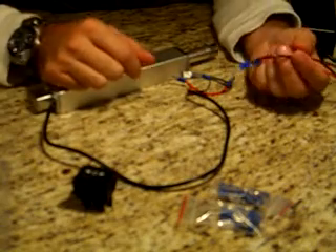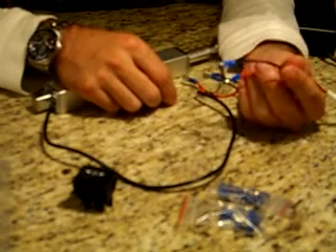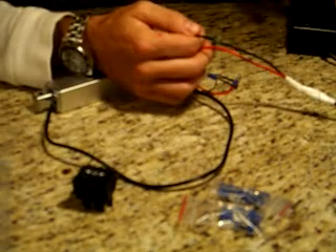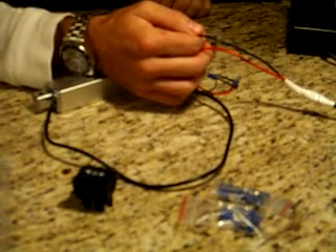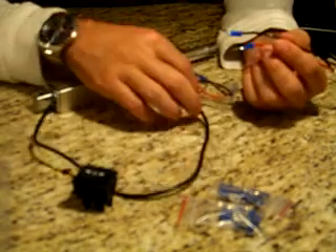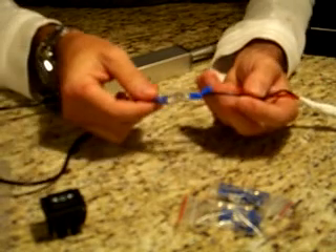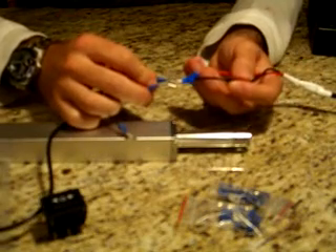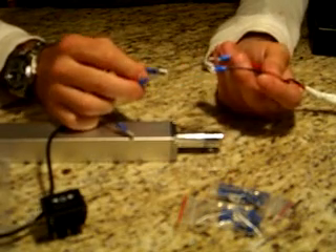First of all, if you don't want to use a switch you can hook the actuator directly using just the red and black wire — a positive and negative wire from a power supply. In this case we're using one off the website, or it may be just a car battery. Using the two wires from the actuator you can hook it up directly like this and make the actuator move. Just reversing polarity changes direction — simple as that.